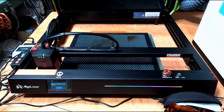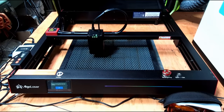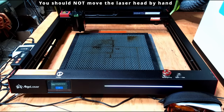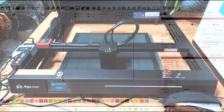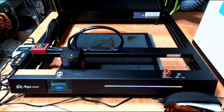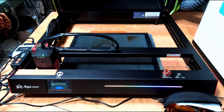I can also move the laser head by hand in LightBurn. Going to the map icon and moving it to the center - it moves fine. Clicking up at the top and down at the bottom, it's working perfectly everywhere. Hitting the home button - homing is painfully slow, but I can put up with that. Now I know everything is working properly. I've put a honeycomb bed in there with an aluminum plate under it to protect my fireproof plywood, and I'll use absolute positioning for the tests.